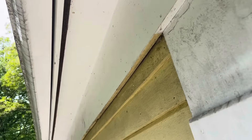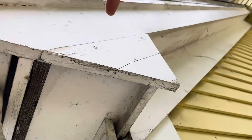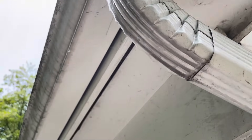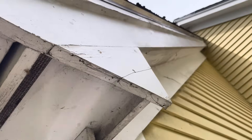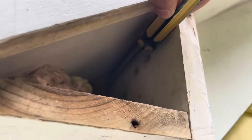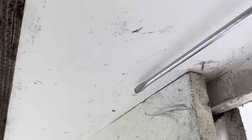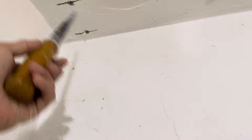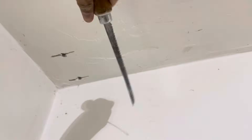I'm on a ladder and I'm going to open up this soffit panel — it's already cracked so I'll try to get these nails out and see if I can access the inside. My hope is that the inside will be a hollow cavity so I can literally just fish over the ceiling joists to my box. Here's the inside of the soffit — there are actually joists that divide it up so it's not hollow, but there is insulation. Using a screwdriver as a gauge you can see the joist ends about right there, so we'll put the beacon on the other side of that and fish into the garage. The plan is to drill up and run a piece of conduit to get the wire up, over, and then down into the soffit.